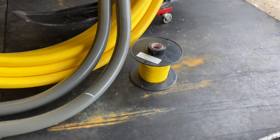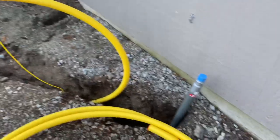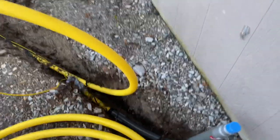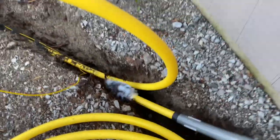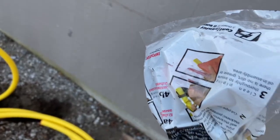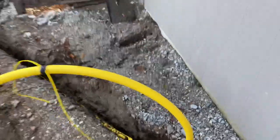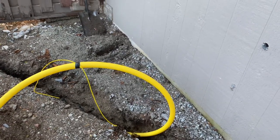All right, I'll show you the other end. I've got my down pipe here, just a mock-up to show you guys. I forgot to mention something I left out — I was telling you in the other video that I was going to do this connection myself. But this bag here doubles not only as protection for the coupling, but also as an instruction manual. If you read the instructions, it says that wherever I decide to cut the pipe, after I make a flush cut, I have to chamfer the end of the pipe.